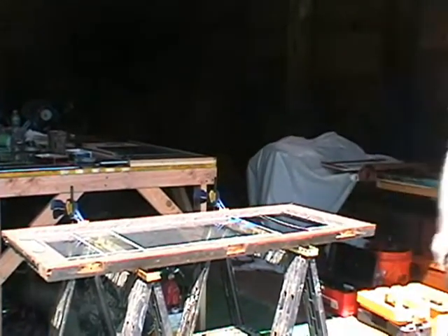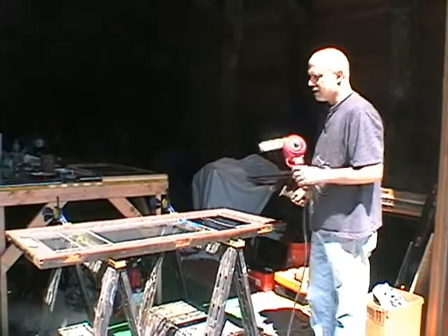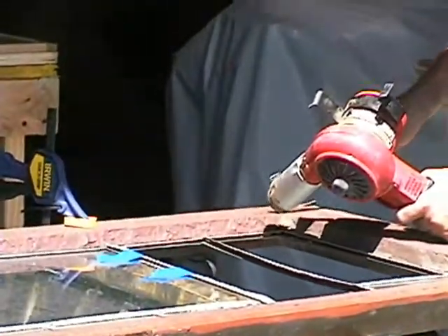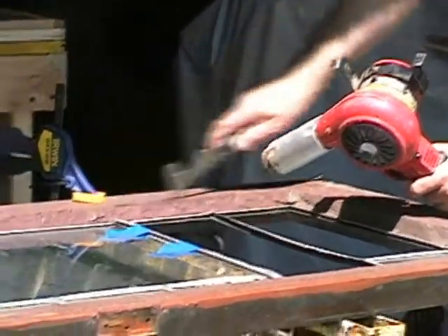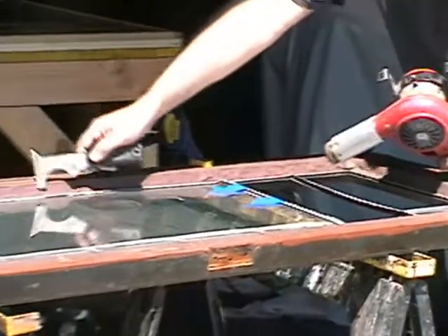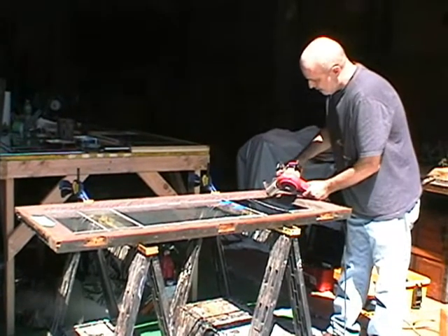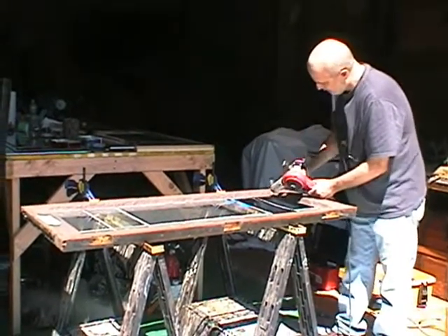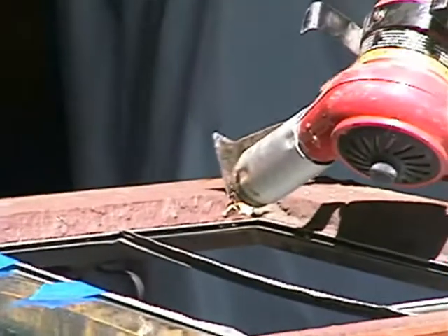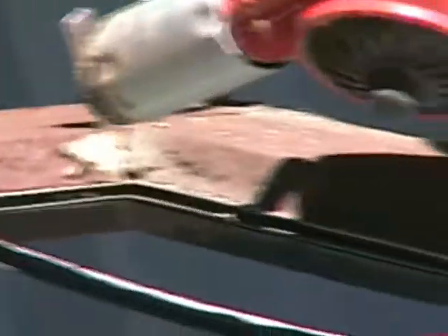I'm going to have my heat gun done warming up here. I'm going to remove the putty — I'm not going to try to burn it or melt it completely. All I want to do is just get it soft. I'm trying to get my knife in there and get all this old putty up, but I don't want to damage this edge. I have to be really careful not to hack it up because that's going to be my guide when I put my new putty in, and I need it to be a really good straight line. So it's a matter of taking it really slow, working away at it, getting it soft. Some of this putty has been on here for almost 90 years.